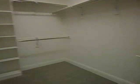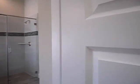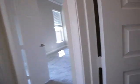Coming along, this is the master closet. Pretty good size. This scuttle hole, it should be insulated. It's hot. I got an infrared image of it. It is broadcasting heat down in here. And the heat goes to less heat, so it's always migrating in here.